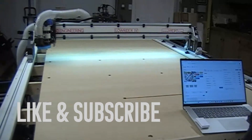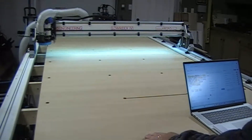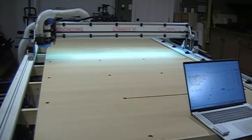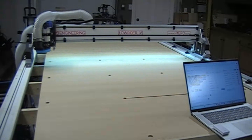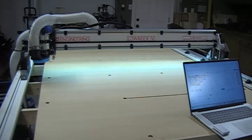I will say, all in all, even with the errors, I was pretty impressed with how the holes in the spoil board lined up perfectly with the holes and the threaded inserts in the table itself. The next thing to do will be to use a V-bit and carve the spoil board grid, which will allow me to position things accurately. Stay tuned for that.